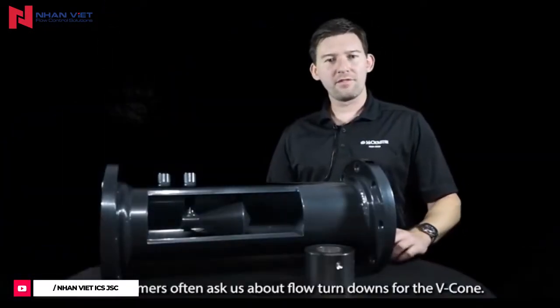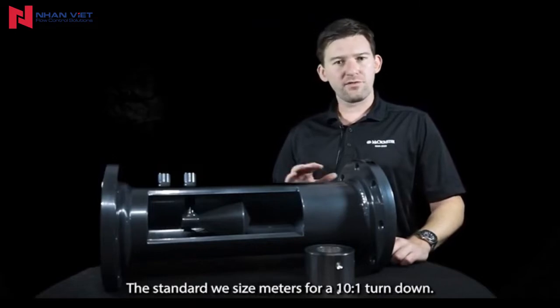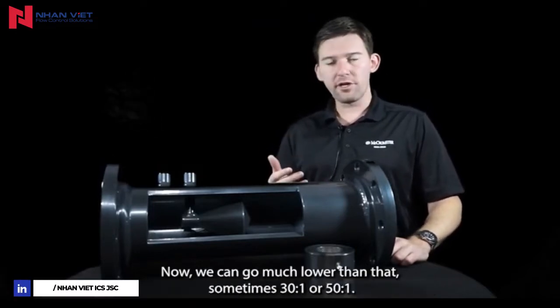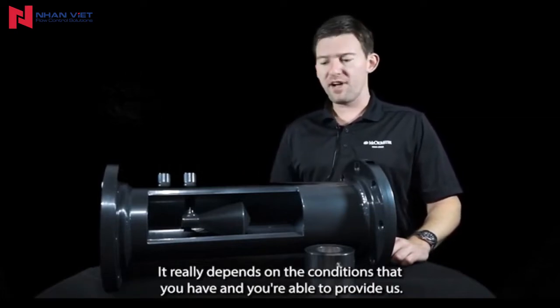Our customers often ask us about flow turndowns for the V-Cone. Standard, we size meters for a 10-to-1 turndown. Now, we can go much lower than that, sometimes 30-to-1 or 50-to-1. It really depends on the conditions that you have and you're able to provide us.